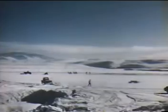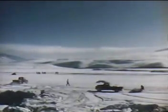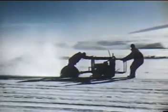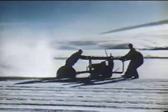High in the Rockies, 150 miles up the Colorado River from Palisade, ice ponds are flooded with water which freezes quickly in sub-zero temperatures. When the ice reaches a thickness of 14 inches, loose snow is scraped off and the ice scored into 2-foot squares by a circular saw which cuts only partway through.